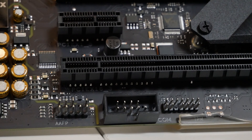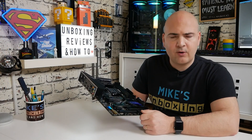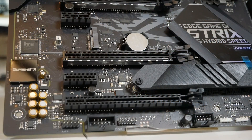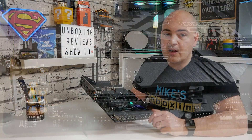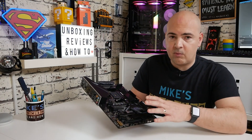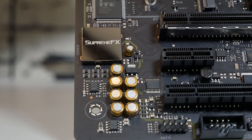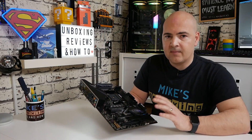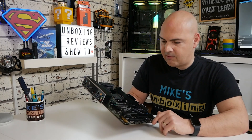There's a TPM (Trusted Platform Module) connection at the bottom, and a COM port which is still included even in 2021. Next to that, there's the audio front panel connector for HD audio — the audio on this is SupremeFX, based around a custom version of the S1220 chipset from Realtek. This supports 7.1 audio, and also features AI noise cancelling for the microphone no matter where it's plugged in — whether into the mic jacks or via a USB mic, the sound profile carries through automatically. That is a really clever inclusion.